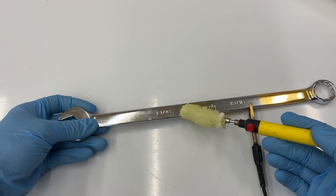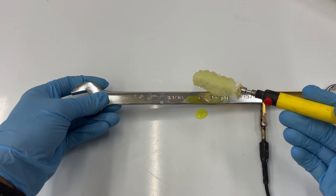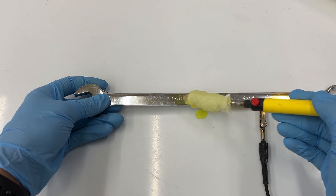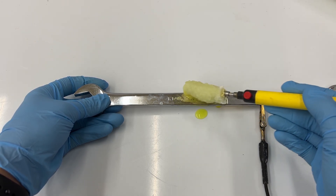If you're using a brush plating setup, as you begin to apply the chrome stripping solution to your item, you will be able to visually see the chrome coming off as the sleeve turns a dark yellow color and the solution dripping off from the item also darkens with a yellow color.